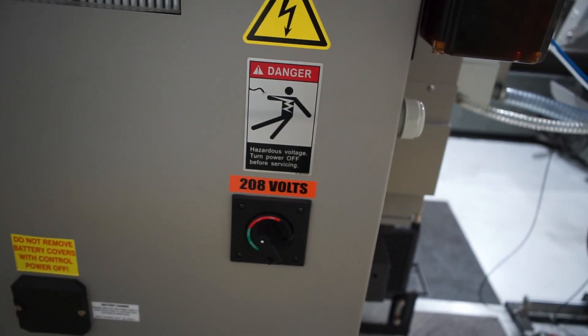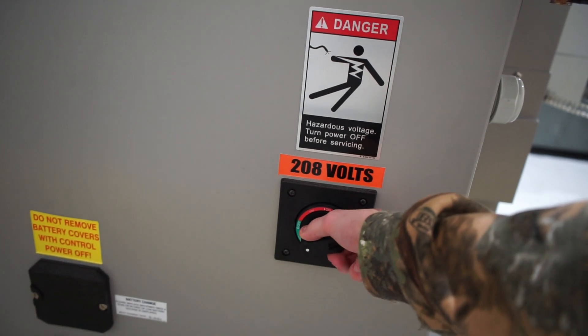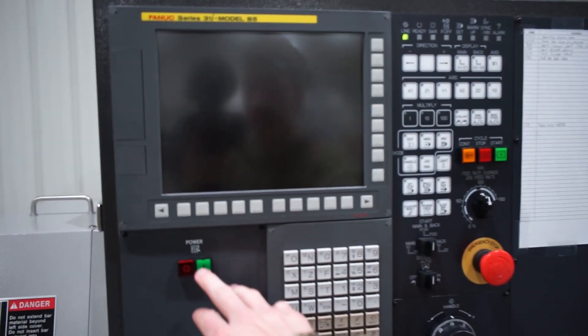Coming around to the back — this is what it would look like in the morning if the part count ran out or all parts were completed. You'll see it's in trip mode, which looks like something bad happened, but this is just how it turns the machine off. We'll go off and then go all the way to reset, then turn it back on. Coming back around to the front, I'll hit power on. When the screen comes back on with the part count, I don't think it will turn back off, but if there's an error — say the chip conveyor clogged and limited out — that error will still be up and you'll have 60 seconds again to turn that power-off function back off.